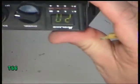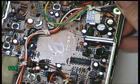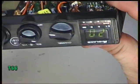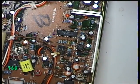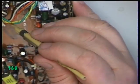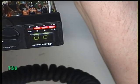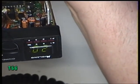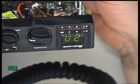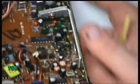Now it's got these fairy lights, and at the full 4-watt output we should be lighting all 4 — which it is doing. But I just want to make sure. The preset RV103 is the one to the right of the one we've just been doing. So we'll just adjust that — it's just on the 4. Now when I flick it to low power it only lights 1; back to full power it lights 4. So that's set up right.